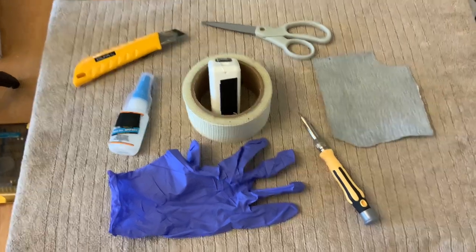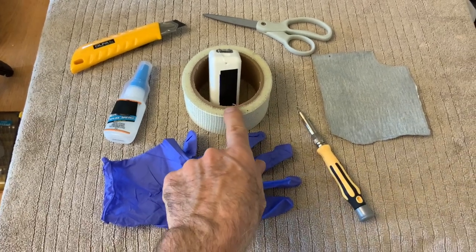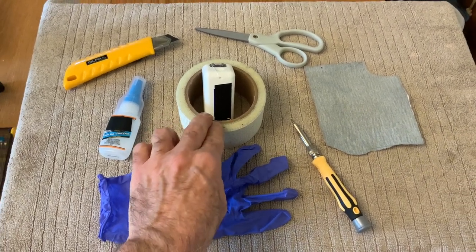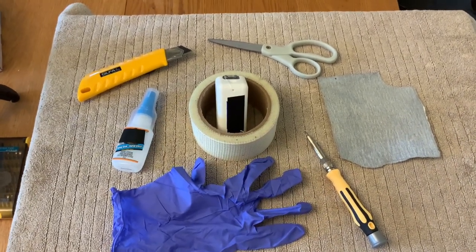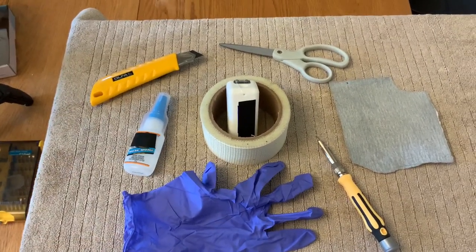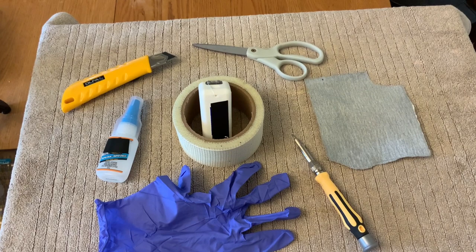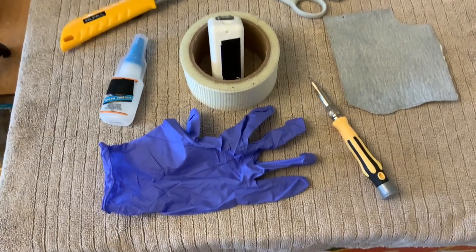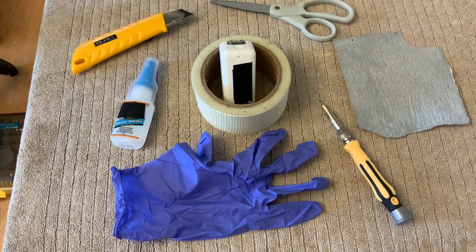Here are the basic things you're going to need for this project: some super glue, some drywall fiberglass tape. If you don't feel like buying a spool of that and don't have anyone to borrow from, you can also use dental floss — it's super strong, just anchor it at one end and wrap it over and over again 10-15 times. That works pretty good. And sandpaper — I used a medium kind, about 120-180 grit. When you're working with super glue, a couple of rubber gloves are always nice to keep it off your fingers.